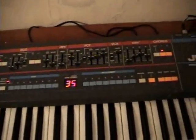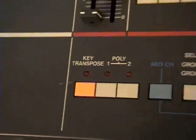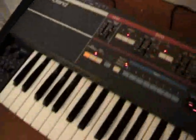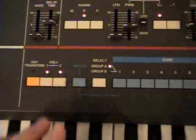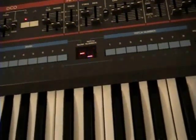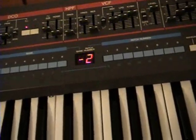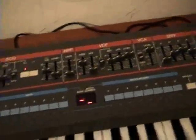So how do we figure out which chip has died? I'm going to turn it off, then hold the key transpose while turning it on. This diagnostic mode comes up. Now we're going to press poly 1 and 2, and when we look at the screen and press down — obviously, chip number 1 is the one that's not working. That's the faulty chip.